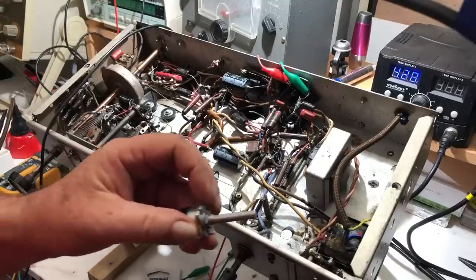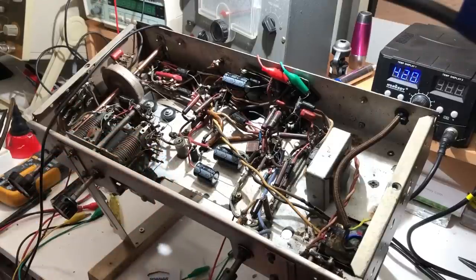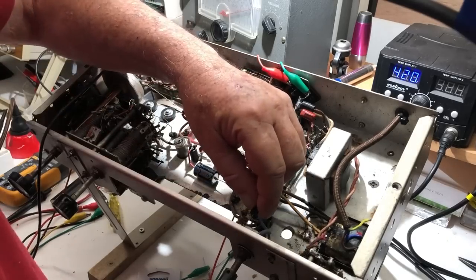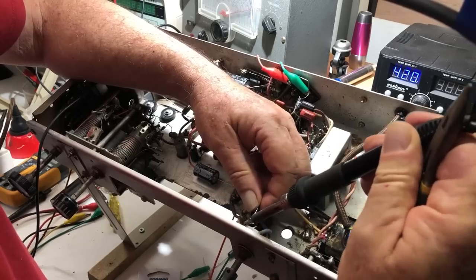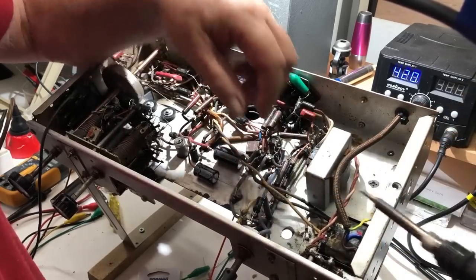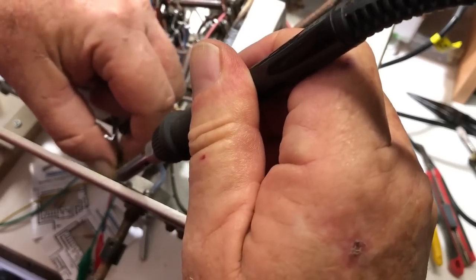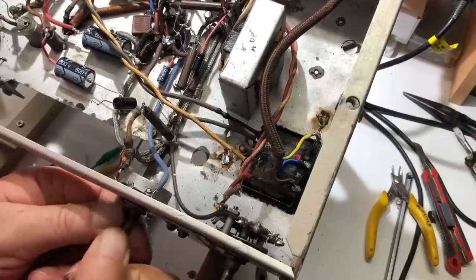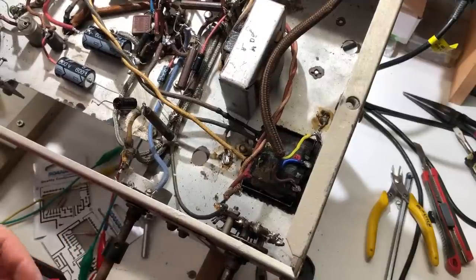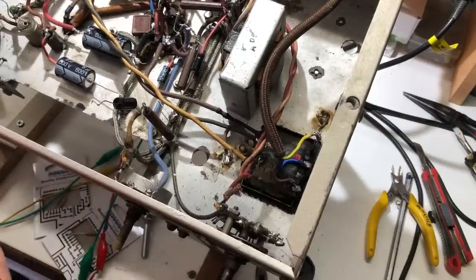I will have to extend the spindle but Carl very kindly included a couple of spindle extenders in the package. Being the volume pot, I'll just take the tapping off here, this one off here, this one off here, and off its knob. I do have a shaft extender on this so I probably won't need to use one of Carl's, but I might have to trim the shaft of the new pot to get them all to the same length.